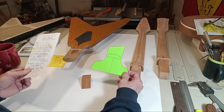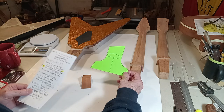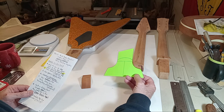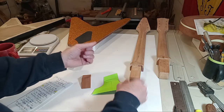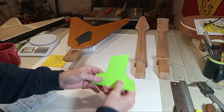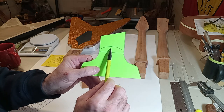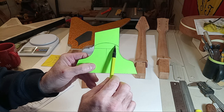This design I'm holding is from a 1975-to-1984 Gibson custom Les Paul that I restored about nine months ago. I incorporated that heel tracing into the last Flying V I built — the red sparkle one — and it looked incredible. It gave it just enough modern appeal that it felt great as a player but also looked a little bit historical, because the historical Flying V has a much straighter heel that radiuses over with a very tight small radius.